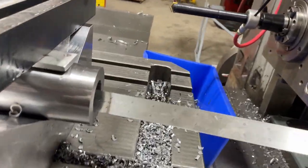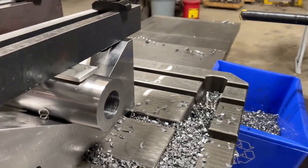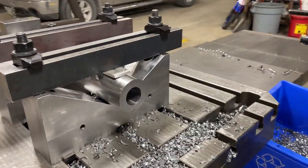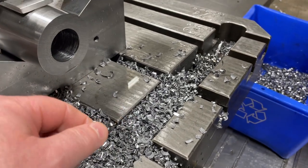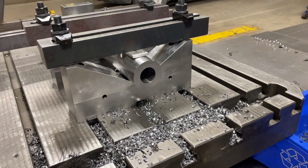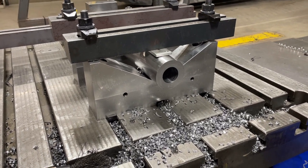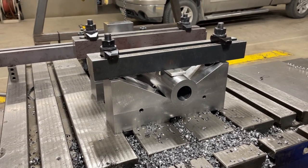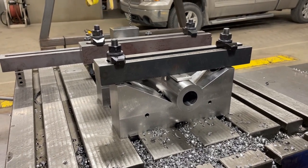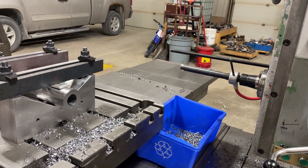That's the hole — it's about six and three-quarters deep. I'm very impressed. It's so fast, and this nice small curled swarf is easy to deal with — it doesn't get wrapped around stuff. It's quite a step up from a twist drill. In fact, the bottleneck now is the amount of time it takes me to change the part over. Even though that doesn't take that long, it still probably takes two and a half times as long to change the part as it does to drill it now, which was unheard of before. Anyway, I'm very impressed and I think I'll probably be doing more spade drilling in the future. Thanks for watching.